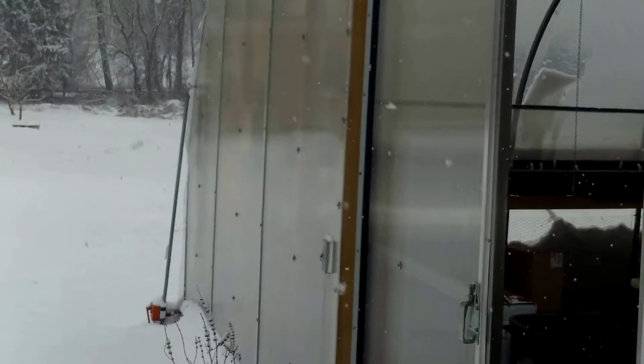We'll show you the outside here so you have a better idea what I'm talking about. This track here, there's about a 1/2 inch gap in there, and so that makes it more than 2 feet on center. So go 2 feet and a 1/2 inch or so on center, and that should get all these lined up real nice. But that's about all I got to show you on this.